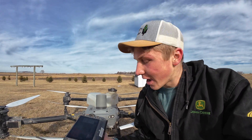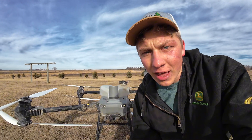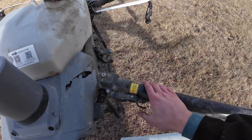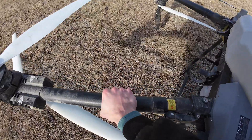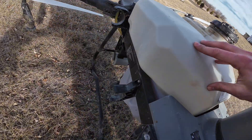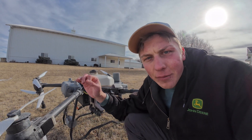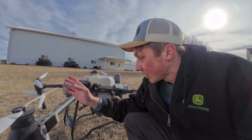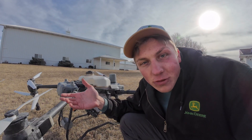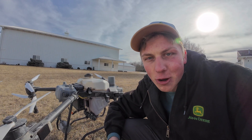My likes and dislikes on the DJI: I absolutely love the user interface — love that there's a screen on the controller and it's all built in one. Also love the camera since I can scroll it up and down. I like the sensors on the arms that confirm everything's installed correctly before takeoff. What I don't like: the smaller 10.5-gallon tank, I wish it were bigger. Also with just one battery, I'm not a huge fan of the fail-safe — if something goes wrong with the battery, the drone would just fall, whereas the XAG has two batteries so if one fails the other keeps the drone off the ground.